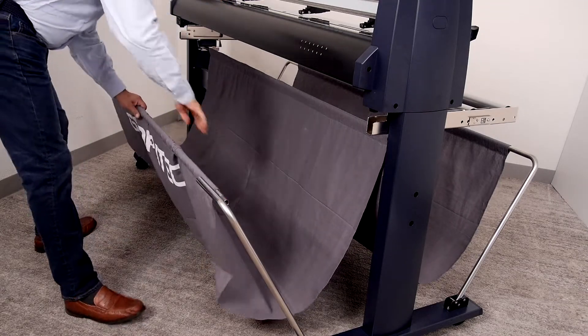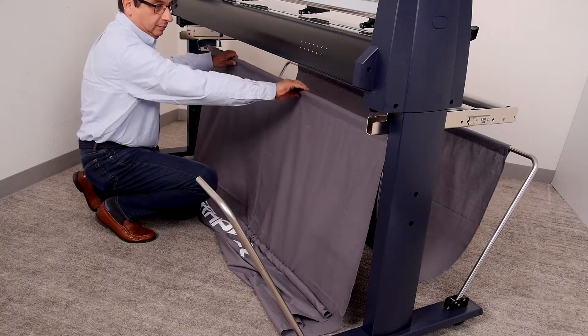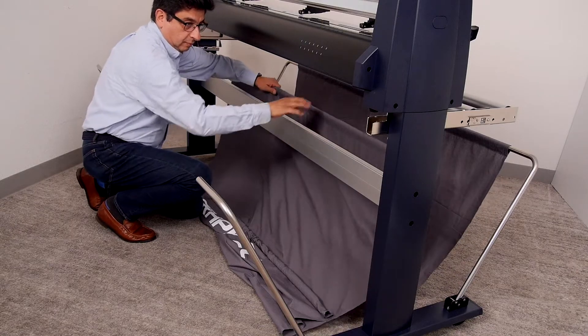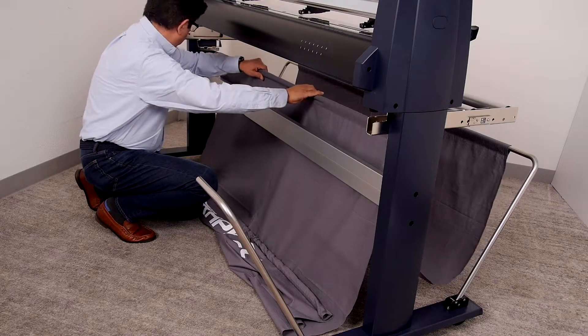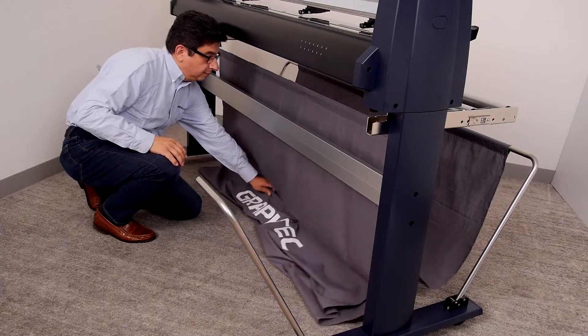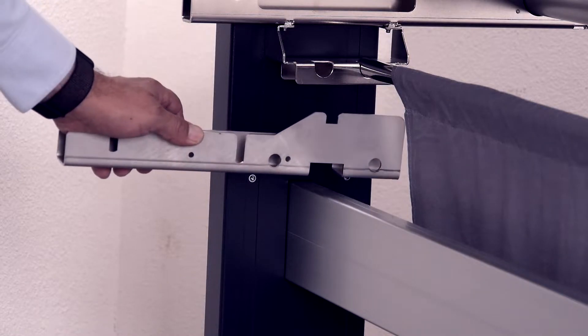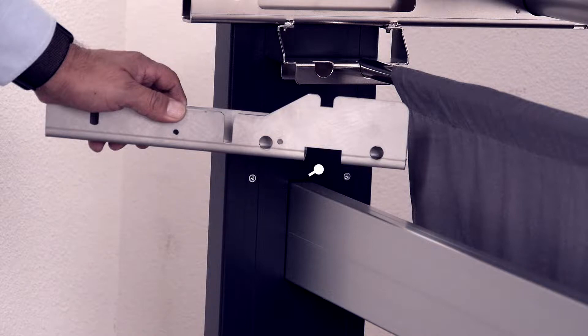Go ahead and remove the front part of the basket. Next, take the middle bar of the basket, wrap it underneath the crossbar, and place it in the back slots of their brackets — this helps the take-up reel unit run unobstructed. Mount the take-up roller bar brackets to the stand leg just above the crossmember, taking note of the slot that fits onto the crossmember.